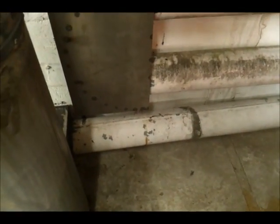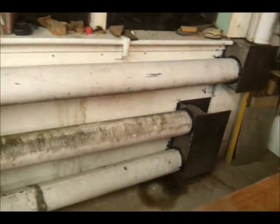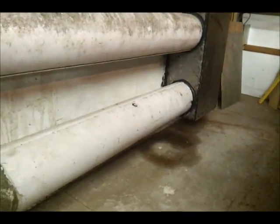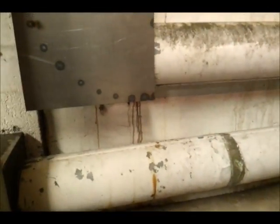A conventional rocket stove has these pipes underground - they build settees and beds on them - but I've got a concrete floor and I didn't want to rip it up, so I figured why not run it along that wall, same thing really. What I plan to do is build brickwork around that bottom pipe - there's about six or seven inches underneath it - fill it all in with brickwork and mortar to give me my thermal mass, so that pipe will heat that mass up.